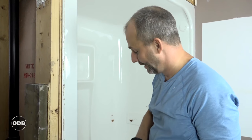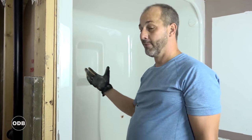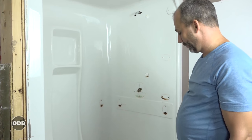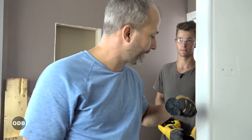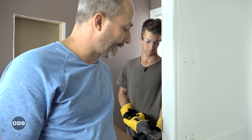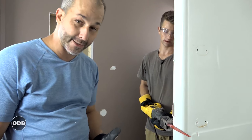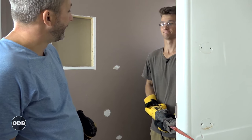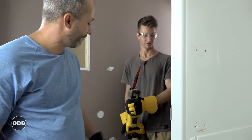It's a little big and nasty — you may find it easier to just take the sawzall and cut it into thirds so it's easier to carry out instead of maneuvering through all the doorways. They come in one piece and they leave in many. This is a six-dollar blade — you can use a sawzall, hand saw, jigsaw, circular saw, or even a hammer and chisel. It's easy to cut — go ahead and give that a rip.